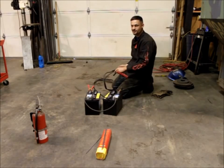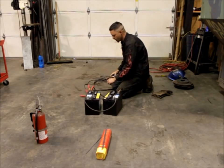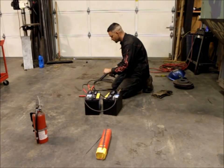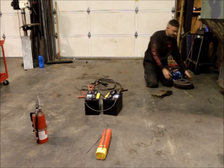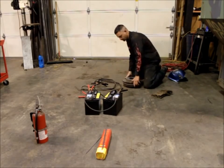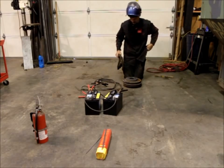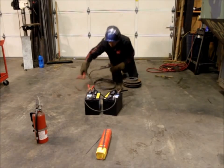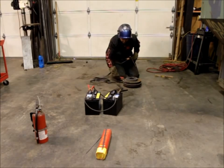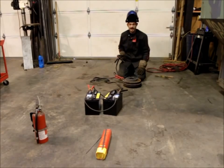Because we're using essentially a constant voltage source for welding, the arc is really a little bit different than what you'd be used to with normal stick welding. I'm going to go ahead and take my electrode and clamp it here in the vice grips. Just for example, I have a set of brake rotors right here. We're going to go ahead and weld these together. I'll go ahead and ground the work piece and lay a couple of practice beads on top of the brake rotors, and then lay a couple of short beads on the ends to actually stick the two of them together.